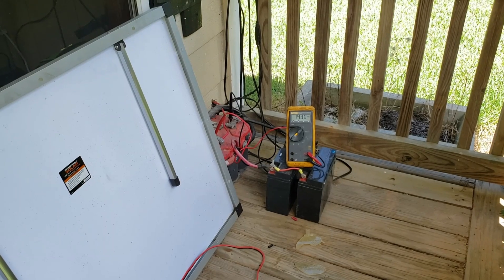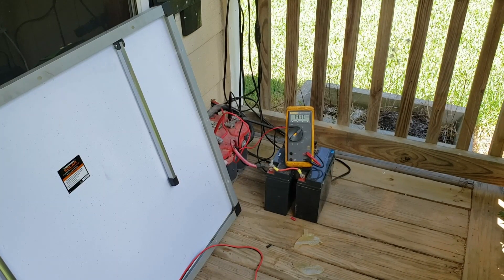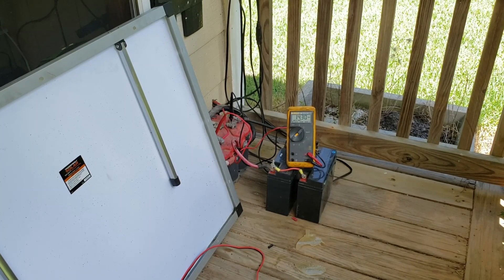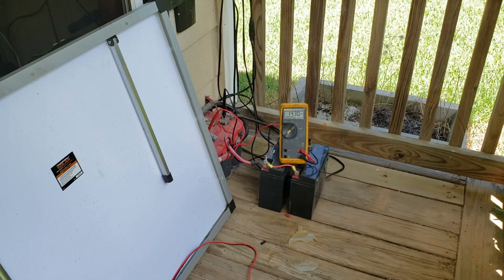Welcome back. Today we're going to look at everything to do with solar and how to get it into a usable form. This is just what I know and how I get power mobile or out in areas where I don't have shore power. There are two ways: grid-tie or off-grid. What I'm showing here is totally off-grid — solar panel to a charge controller, into a battery, into an inverter that converts it back to 120V AC.